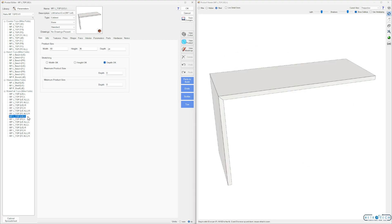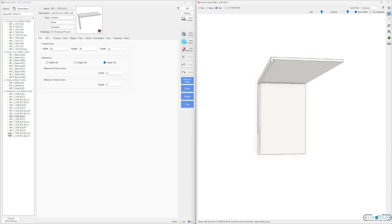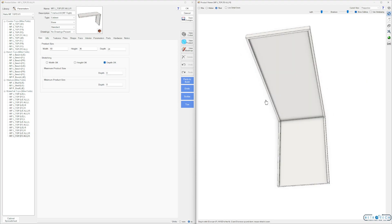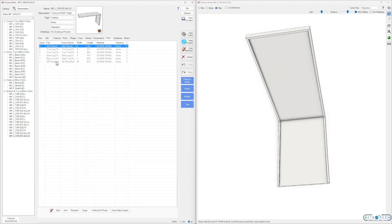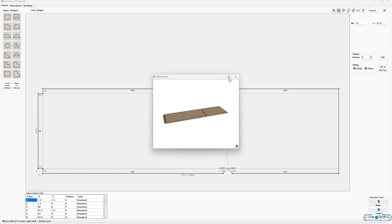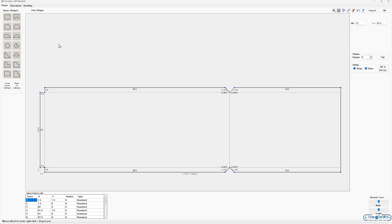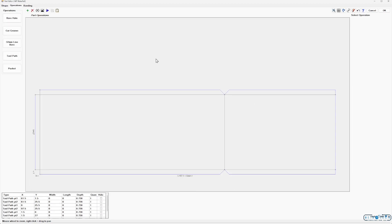So if you don't want a full return on your miter fold, you can do something simple like this. Let's take a look at one of these parts. Click on either Edit Shape or the picture, and there we are. This would be the leg over here, the top, the finished end, front and back. One way to keep track of whether you're doing things right — if you're inside here, right-click on things. Do not left-click anywhere on these points or lines because they'll probably move and you'll lose your formulas.